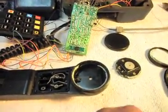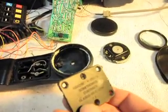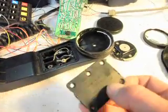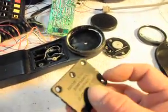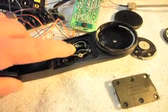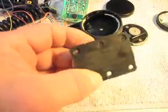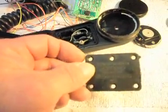When this telephone came in, I was wondering — and you can probably see this — there's a little bow right here on this plastic, and I thought that was kind of funny looking. But I was busy with other things, and that cap — this cover — sits right here. I've worked on enough of these to know there's nothing behind here that sticks out that would cause that to bow. When I got a better look and we couldn't get anything out of the receiver, I noticed the screw had been driven through so far that it actually bowed the plastic and cracked it a little bit. But you'll never know it's cracked because there are so many screws in this plate, and once it sets level like it's supposed to, it shouldn't be an issue.